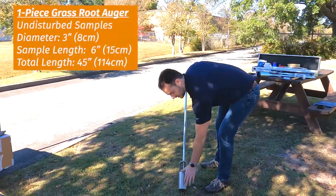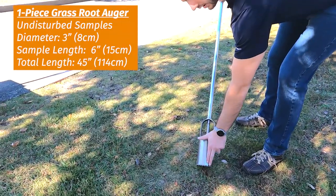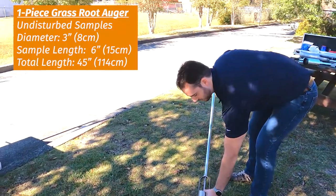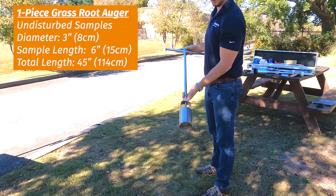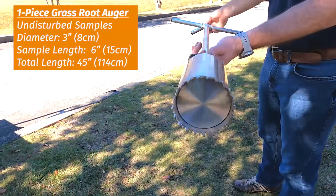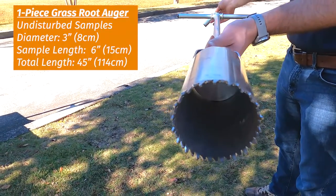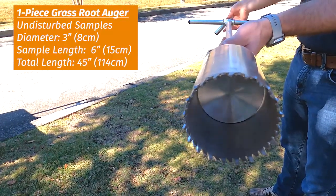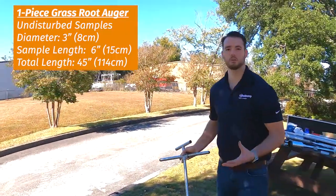What's kind of different about it is it has these cutting teeth that are designed to cut through that top layer very well. It's not really designed to go very deep — you're looking at those top couple of inches — and it has a very large diameter for a pretty large undisturbed sample. It also has that extrusion tool which naturally comes up as you're inserted into the subsurface, and then when you go to push your sample back out, you can just push it out and get that uniform undisturbed sample.